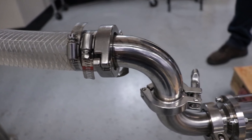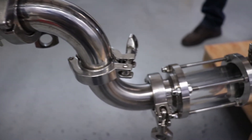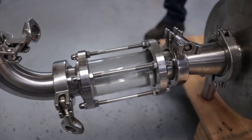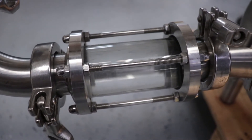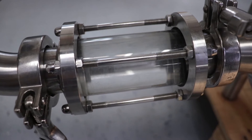A series of elbows close to the suction of a centrifugal pump can have a serious effect on its performance. As you can see, the diameter of the pipe is smaller than the pump suction port, from one and a half to two inches. Also, there are two elbows in series. All of this causes cavitation.